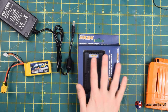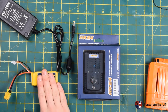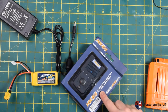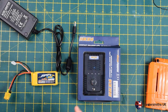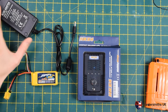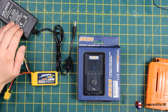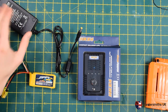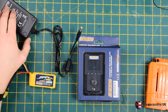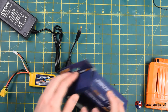In addition to the charger itself, you're going to need whatever LiPo pack you're planning on using. As this charger indicates, it supports up to 4 cells or 4S, so for all your Nerf needs you shouldn't need more than the E4. You will also need a 5-amp 12-volt (60-watt) power supply with a barrel plug so you can connect the charger to mains power.